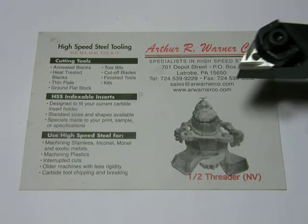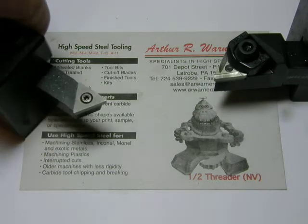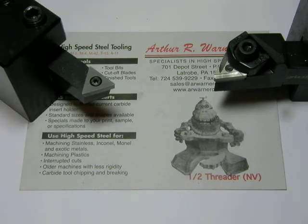These are two that I happen to use. Until recently, most of the inserts we buy have been carbide. Carbide is tough and it handles heat very well, especially if you use coolant, and you get good finishes at high speed. The downside to using carbide inserts is that for the quality inserts, they are very expensive. And when they chip, you can't just re-sharpen them. At the lower speeds, the finish isn't all that good, either.